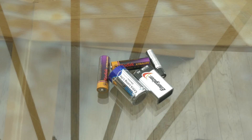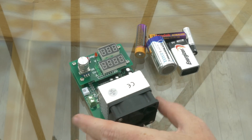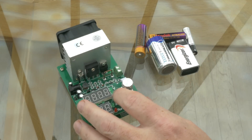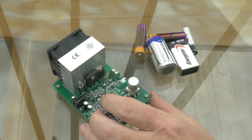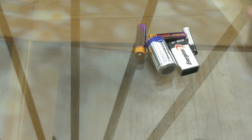Ever needed to check whether a battery has any life left in it? Sure you have. Well there are only two ways to check the capacity and only one of those is 100% accurate. The accurate way is to use an electronic load with a built-in milliamp hour or watt hour meter and drain the capacity measuring what you've gotten out of the cell. But that's kind of defeating the objective if it's a non-rechargeable primary cell and all you want to do is know whether you should keep it or not. I'll show you a simple non-destructive way to get a decent approximation of alkaline battery capacity so you don't end up hanging on to dead batteries or throwing away good ones.